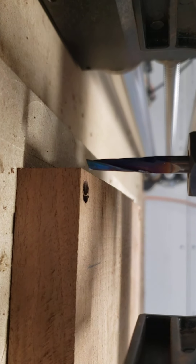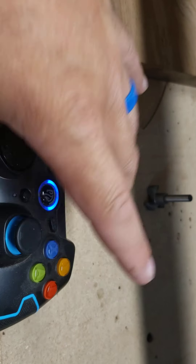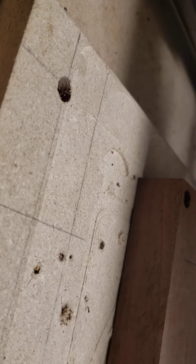Now you might ask, well, it's up in the air — but if you notice, there's a bow in my board. That's why it's not touching the board. So I need to set it to the middle to get the right Z height to start off. What you do is go back to your joystick, hit red because you need to go a little faster than blue, and of course first lift the bit up a little bit and move it to where you want — the highest point.